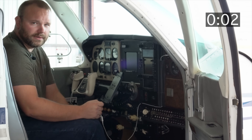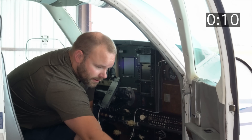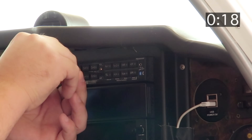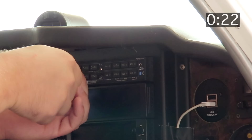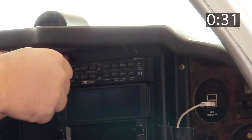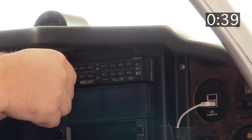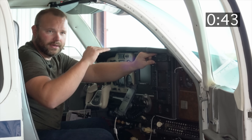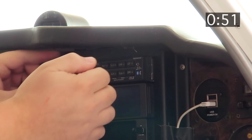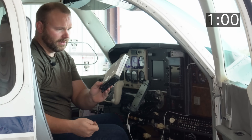The 450 slides right into the existing tray — same connectors, same pinout. So all you literally do is pull the old one out, slide the new one in. We'll take your Allen key, place it in the center connector there, and just turn counterclockwise. You'll feel it loosen up right away, and then once it takes the slack out of the screw, you'll start to see the face of the unit start to slide out. That's kind of designed both to help you get it out of the tray and to take the human error out of engaging and disengaging the pins in the back of the unit.